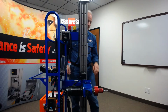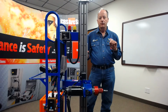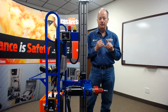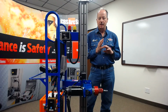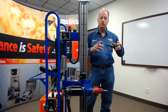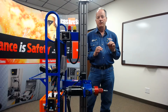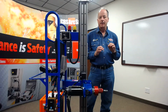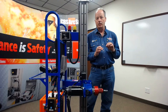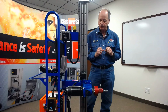There are a couple of exceptions to this for when we don't use our motor brake. If we're dealing with an ABB breaker like an ITE or BBC in the HK, VHK, HKV family, or an ADVAC for medium voltage, which have an interlock where you want the interlock to float after the racking operation is done, we don't use our motor brake. If we're dealing with a low voltage breaker like a Masterpact NT or an NW with an interlock, we won't use the motor brake because again, we want it to float and not bind on the interlock when the racking operation is done.